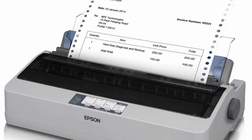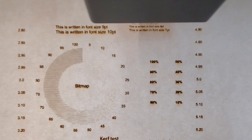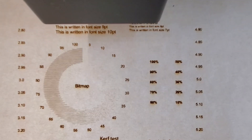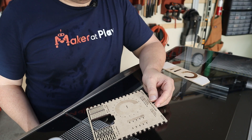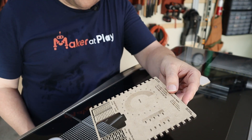Compared to cutting, engraving is a bit different. You can think of engraving like a dot matrix printer — the laser goes back and forth across the material, varying the power of the laser beam when it wants to draw a dot or pixel at that location. When it comes to engraving there is a lot more to think through with the settings. You can use the defaults and things might work fine, but you can fine-tune things too. I downloaded a test template and played with it on some medium draft board to understand the power settings better.